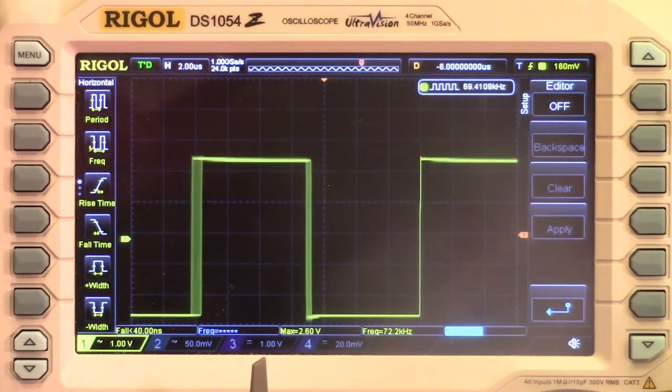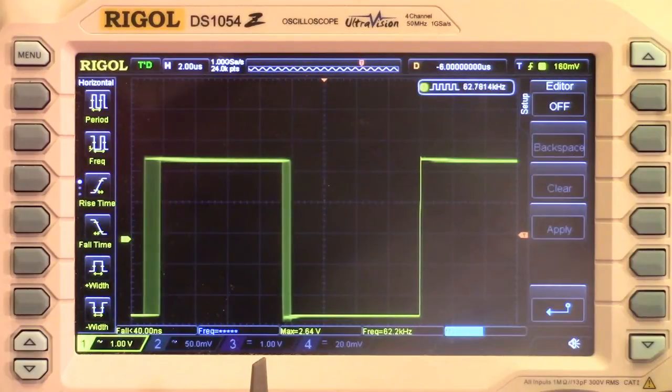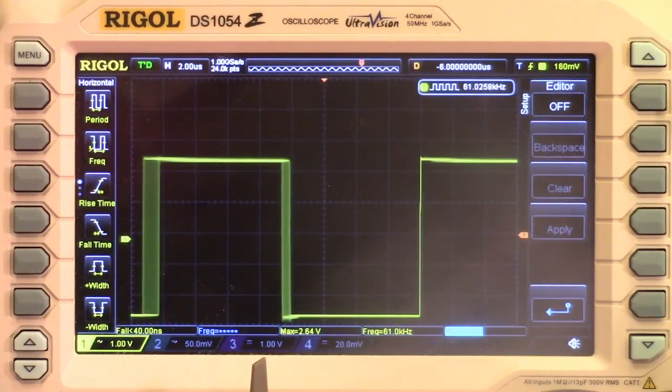My hand's going to be more of a reddish hue as compared to the dark clothing I have on. So there he's 74, 75, 76 kilohertz. I take my hand away, and he drops back down to 60, 61, 59 kilohertz. So pretty sensitive. Through that, I can determine at least a piece of information about what I'm looking at when I'm examining something. So this would be something useful for the robot to examine its environment. It would be just a piece of information that would have to go along with other data in order to fully determine what it is it's looking at.